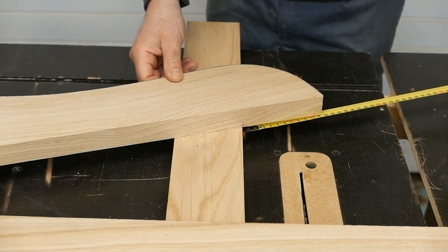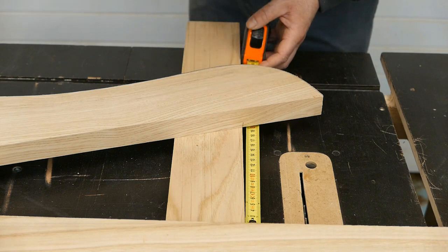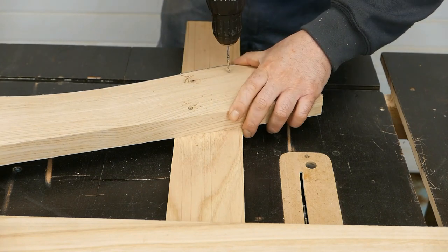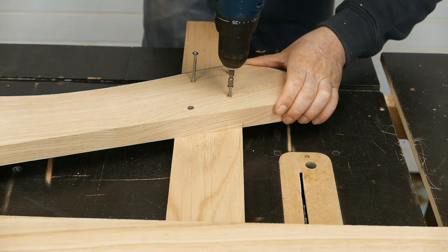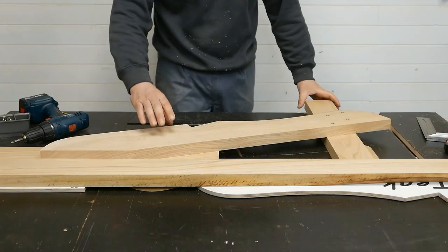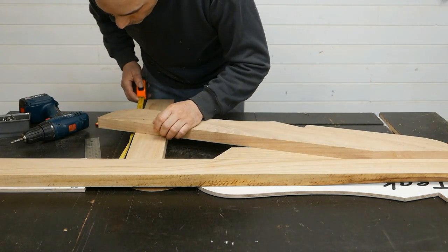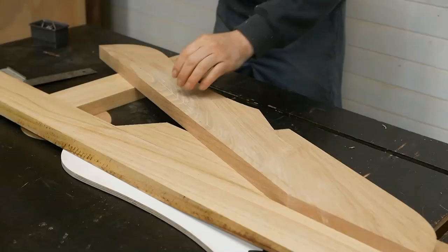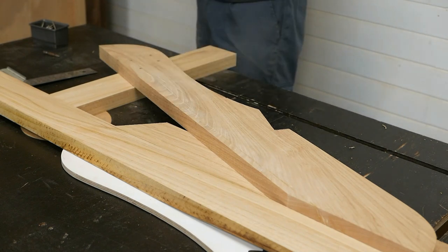Here I have 11.5 cm and here I have about 19 cm. Making sure I don't move anything, I drill 4 guide holes. I will only use stainless steel screws. This is the first side of the Adirondack chair. Now I will make the other side, but notice that this one looks to the other side — like this both sides will be symmetrical. You should also notice that I begin to drill in the side support, not in the front leg.